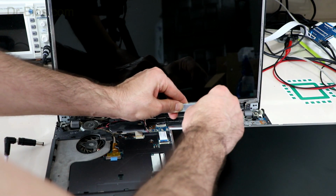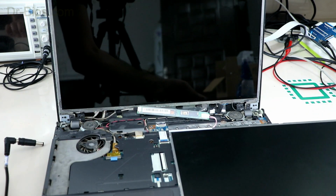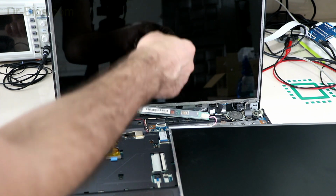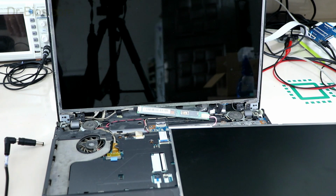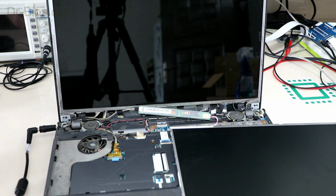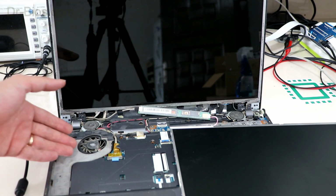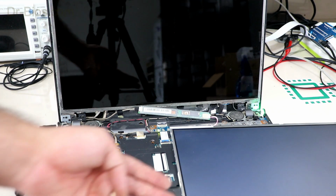I connect it to high voltage. This is 15.4 inch, but I assume this one is 16.4. I should open its bottom cover because its part number shows the LCD size. I'll turn on the device now and see if the problem originates from high voltage or device's backlight. I removed laptop's backup battery so that it would switch on automatically. Yes, it turned on. There is backlight.